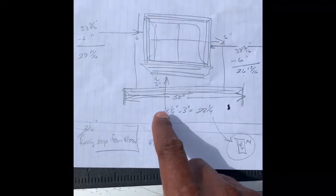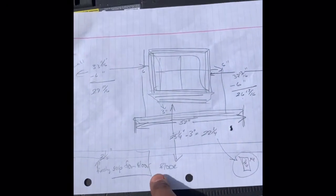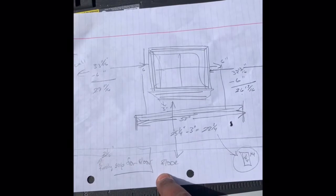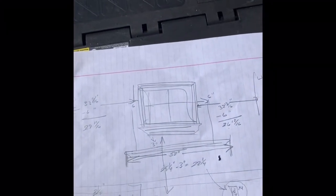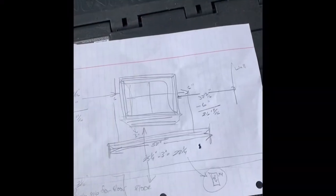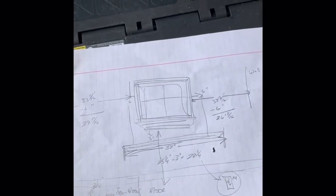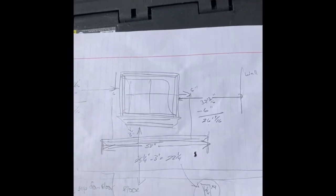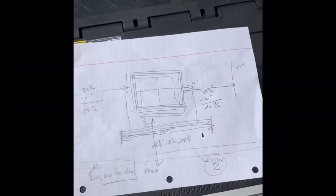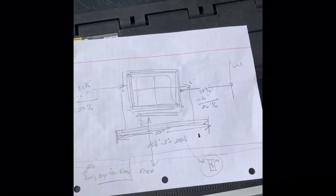So essentially what I'm gonna do is put a furring strip on the wall, since I'm not gonna remove the baseboard, and I don't want the pieces themselves to have an issue with backing right up against the wall. If you just add a furring strip, a 1x4, then that'll pull it off the wall as far as your baseboard is. It's also a good idea because if you don't do a good job, you can always just throw all this away, repaint the wall and caulk the holes, and it'll never look like it was there.